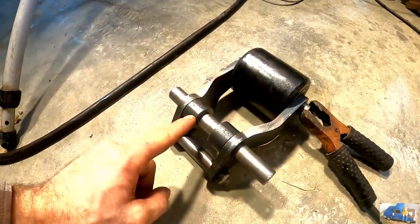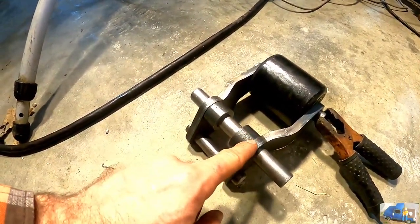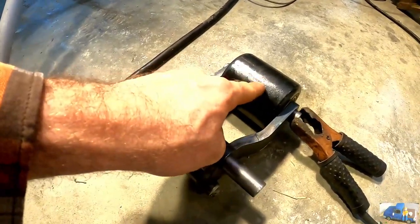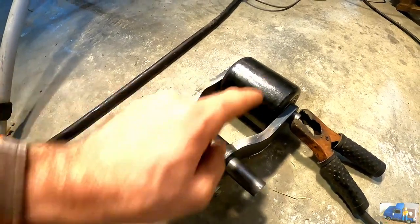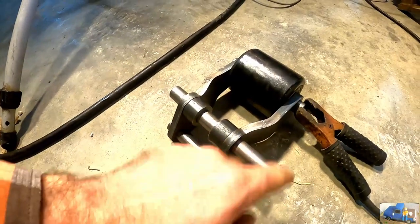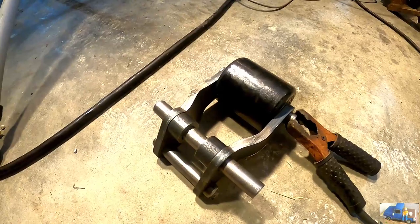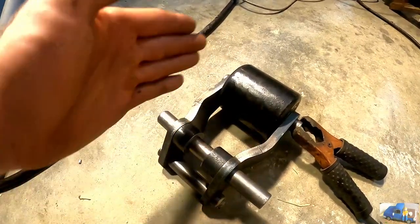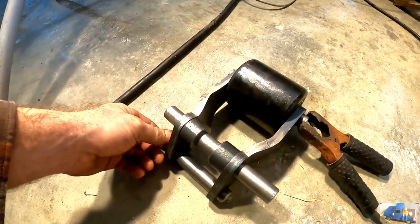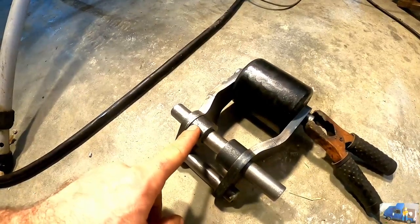We have the bushings that we just turned and bored that are going to be a bearing surface extender for the bracket on each end. We have our new phenolic rollers and bearings. And right now we just have the new shafts, or rods, slipped into the brackets to make sure it's aligned, because it can move all sorts of directions. We want to make sure these bores stay aligned when we tack these bushings in place.